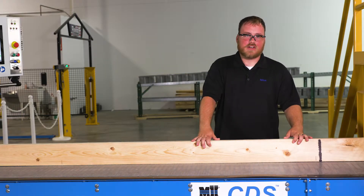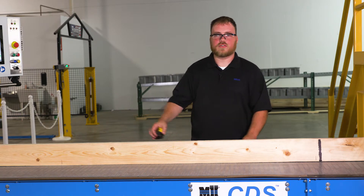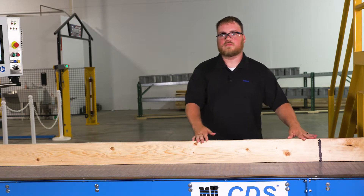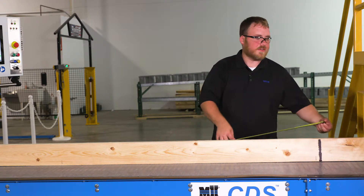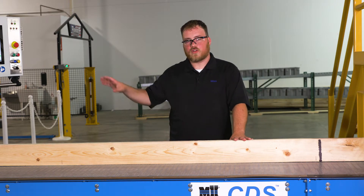For systems with multiple printers, you will see these same marks on the top and the rear of the board. Take the same measurements as before and put them in the corresponding boxes on the touchscreen. Once we have these measurements, reload the board into the saw and it will make a second set of marks. These marks are measured the exact same way — from the front of the board to the center of the marks — and entered into the corresponding columns on screen.